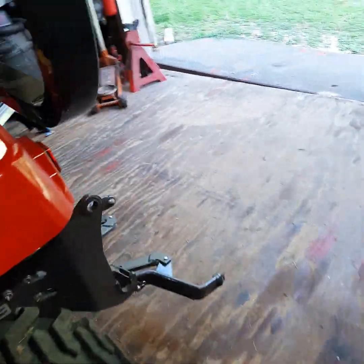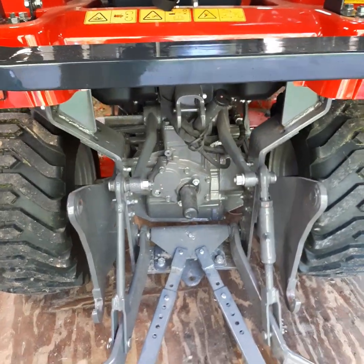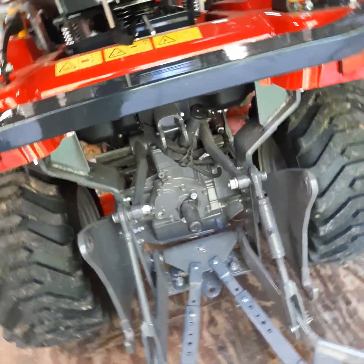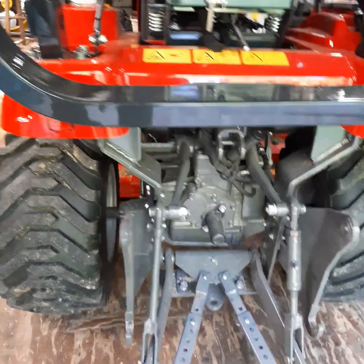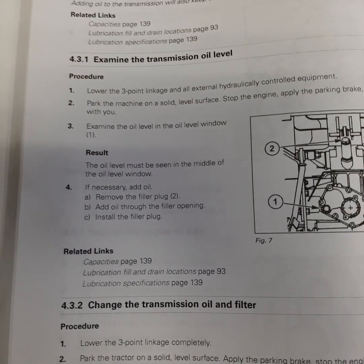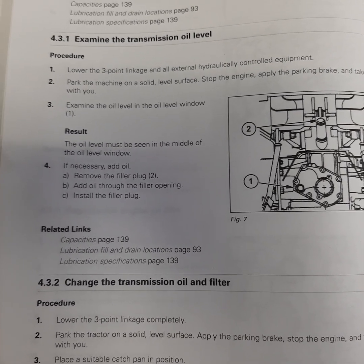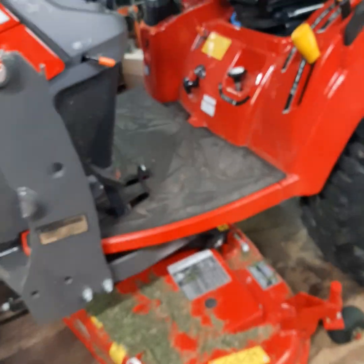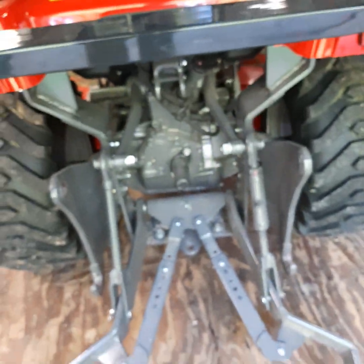So let me look into this hydraulic level. With the backhoe on it you can't see it — it's impossible. But I did find that if you tilt the unit one way or the other you can make that level rock up into that sight glass. Now the manual says cut the engine off, lower all hydraulics, and in that mode you should have an oil level. Right now all hydraulics are lowered and my oil level is not in the glass.